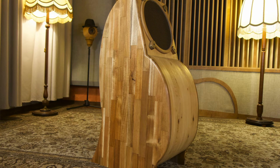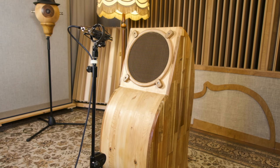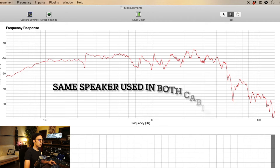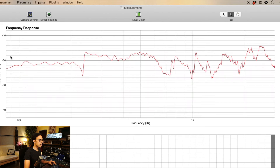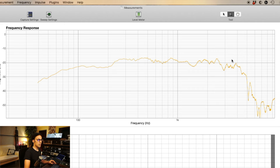With these little experiments being quite promising, I tried to bring this to the extreme by building a guitar cabinet which has as little parallels as possible and is also filled with acoustic wool. As a reference, here we have the basic square cabinet we started with, and this is my custom cabinet. It's much, much smoother — we don't have crazy bumps like these. All the comb filtering effects up here are almost completely gone. So we see that by working on the shape of the cabinet, we can drastically change the sound of the speaker itself.